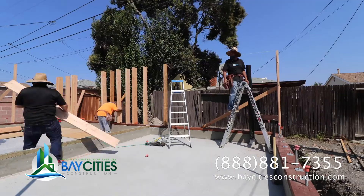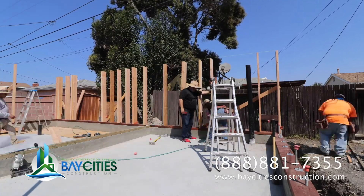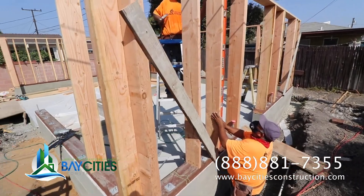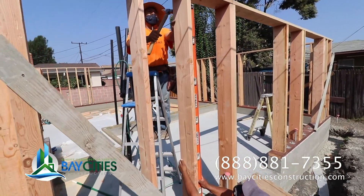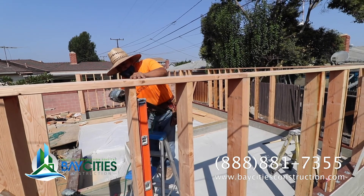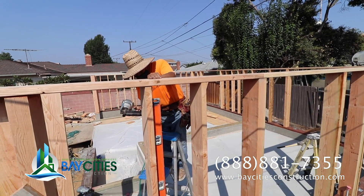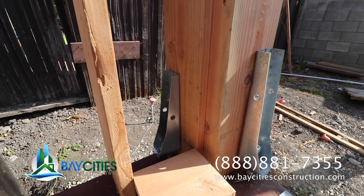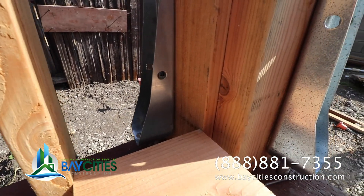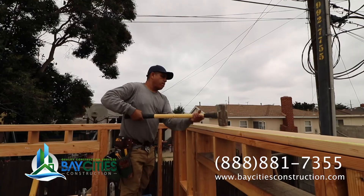Starting at the ground floor, you can see that the guys have put up the first floor walls. These walls are huge — they're two by eight walls. Standard wall height for a two-story building would be two by six walls, but because we had to re-engineer the foundation stem walls — notice the concrete stem walls, they're really thick, eight inches thick — we would have had to fur it out and do all sorts of crazy stuff to hide those stem walls. So what I decided to do is just use a larger dimension stud wall. We ended up doing a two by eight, and we get a pressure treated three by eight, which is that brown wood on top of the concrete. Going with a larger dimension wall helps in a few different ways: it helps us install the infrastructure, there's a bigger void in the wall for plumbing and electrical, and it also is a stronger structure, increasing stiffness and earthquake performance of the building.